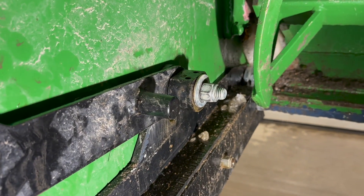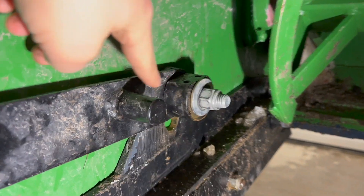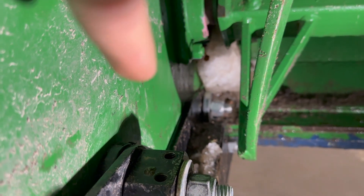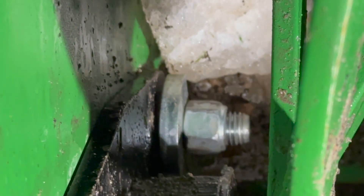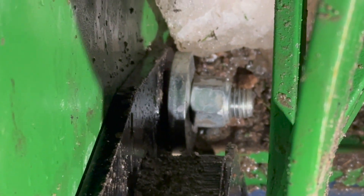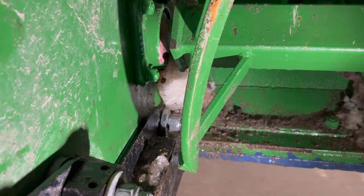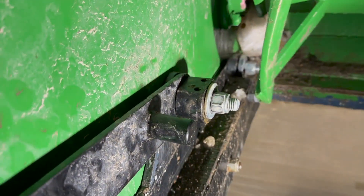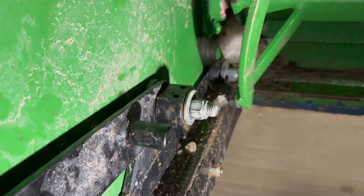But if you want to make it a bit smoother, you're going to have to grind down all the bushings. You're going to have to open it up in here and get the bushing out, grind that down — and then there's another bushing in the back right there where my finger's pointing. That one's not too bad, I don't think you're going to have to touch it. You may, though, if you get a bunch of grimy sand like you're seeing in the video — that's what's caught in there causing it to seize up and lock up. So yeah, make sure you check all three. You might be able to just get away with the front, or the front and middle, but you might need to do all three. Just make sure you check all of them.